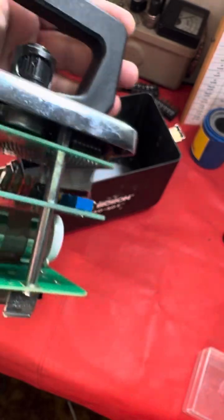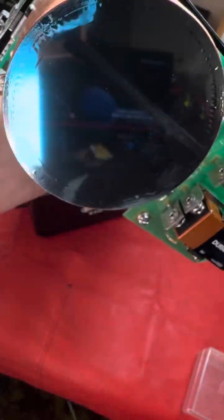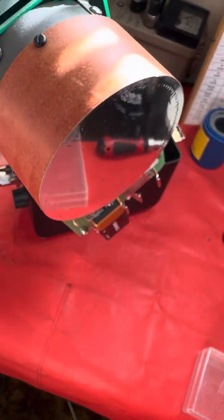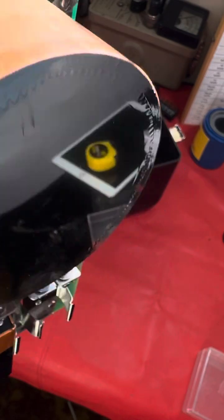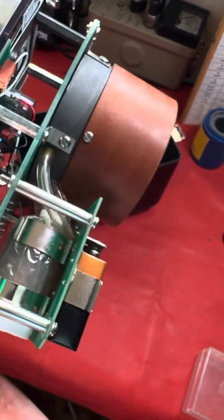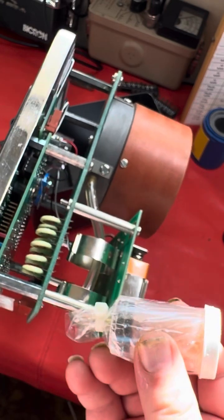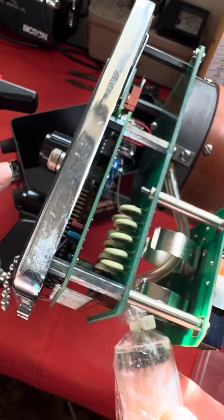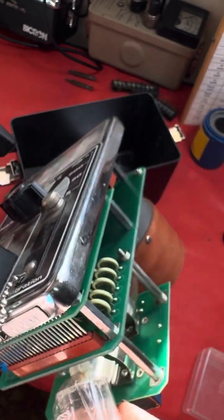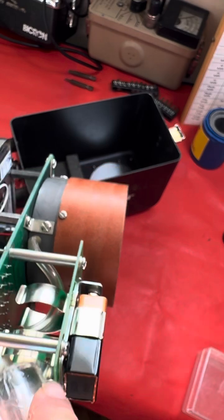There's not a whole lot to show you. So this is an air-vented chamber. It is vented to the atmosphere through a container of desiccant. I prefer indicator desiccant, but replacing it every 6 to 12 months as preventative maintenance is recommended. Let's get that back in there.